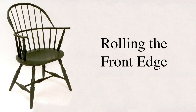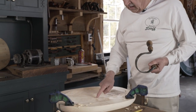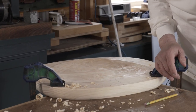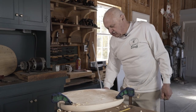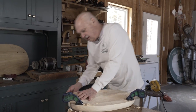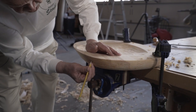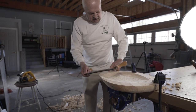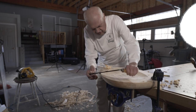I'm done with the scorp and I'm going to set it aside. Notice the plunge cut — there's still a little bit of it showing here. It's going to get smaller and smaller as we move through the next series of operations. But before I make this any more smooth, I want to take wood off the front here to produce this roll. When I make this cut, I'm going down about halfway through the thickness of the seat, so I can make a mark about like that to guide me. My cuts are going to go up to here, and again they're slicing cuts.